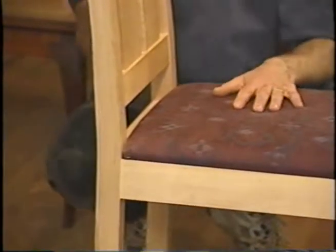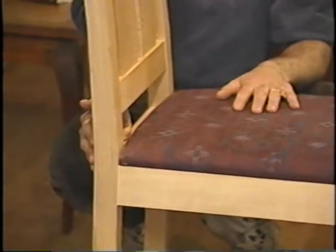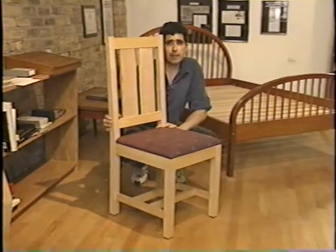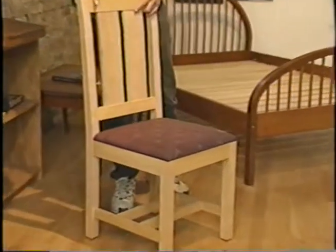You can improve the comfort of a chair considerably by increasing the angle between the back and the seat by about 4 or 5 degrees. This is what I call my craftsman chair, after the craftsman style of furniture made popular at the beginning of the 20th century. The back angle doesn't make this chair more complicated to build. In fact, I still use right angle joinery throughout.